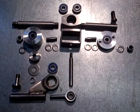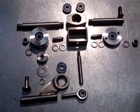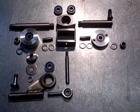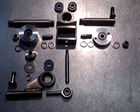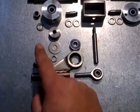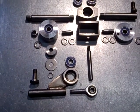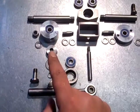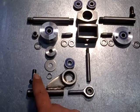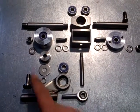So what does it do? It breaks into sub-assemblies — and I know it's difficult to see in this light, but I'll post another video once this is actually up and running and complete and I can show you it working. So very quickly: here's the first sub-assembly, this is the bell crank, which replaces the plastic bell crank. These are little bushes and washers that I made to put this together, and that there is the pin that will hold the cable end. So that's the first sub-assembly.